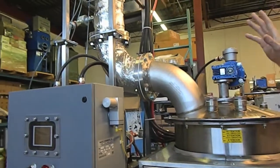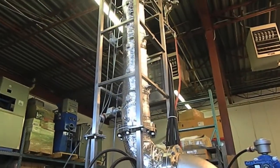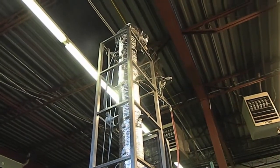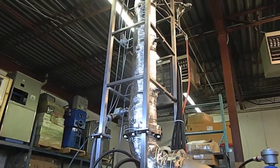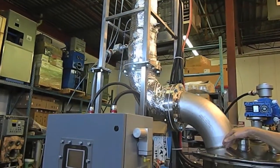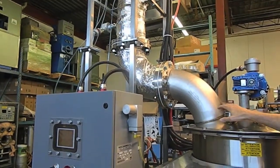This specific unit is also fitted with a fractional distillation column. The vapors come up the unit and go up this vertical cylinder, and there's a packing media inside so that you get a more and more pure distillate. If your application is a very high purity application where your goals are very stringent and specific, we can design anything to meet that need.